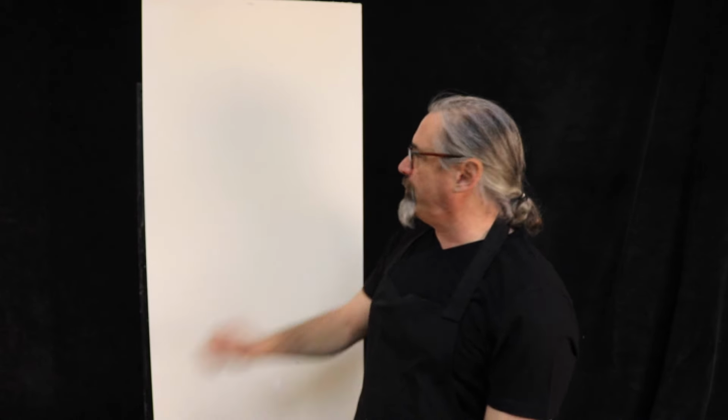The first thing I've done to get ready for today's technique is I base coated the surface using the quartz primer. Quartz primer is an interior-exterior soap and water cleanup base coat for lime base plasters. It's proprietary. If you don't use it, there's a good chance that the lime plaster is going to lose its adhesion due to the high pH content of the lime. It will have an adverse reaction to the regular latex and oil-based primers that we use here in the States, and it could very well pop off the wall due to delamination. Quartz primer prevents that from happening.